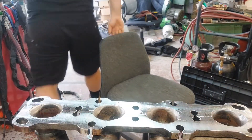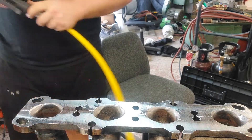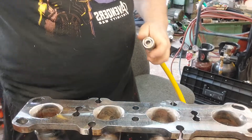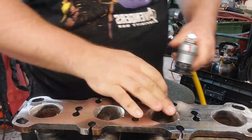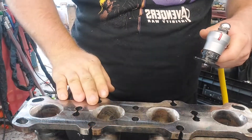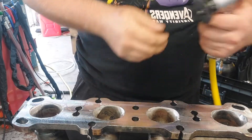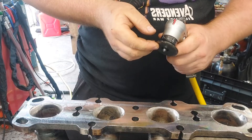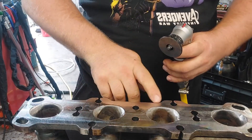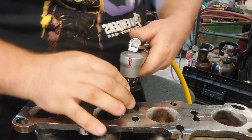I'll get my airline back and drop it outside. Alright, one airline sorted. I'm going to start off by doing the outside perimeter. Now this flange is already mostly degreased, so I'm not going to use any cutting fluid. The inserts are made for stainless steel so they're very hard and resistant to shatter - they're excellent for doing this stuff without any lube.